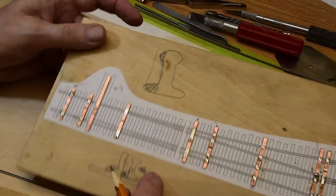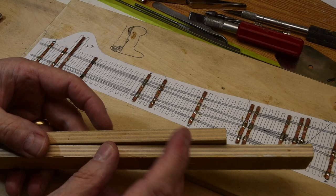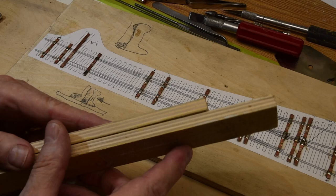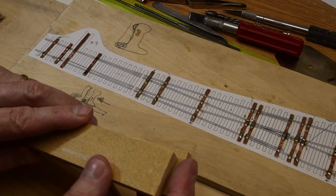So what I do is, remember how I talked earlier about these sanding blocks that you make? Right, these are 3/8, like good quality. You can buy this plywood, the 7-ply 3/8 at hardware stores. It usually comes in small pieces like 5 foot or 2x2 or 2x4. And we use that to cut your sanding blocks because it'll be nice and straight, okay? And rigid. And then, they just come in handy for so many different purposes, right?